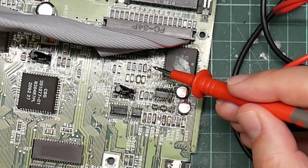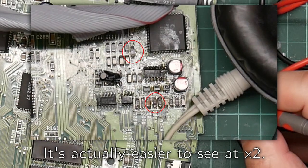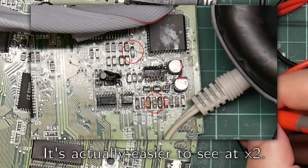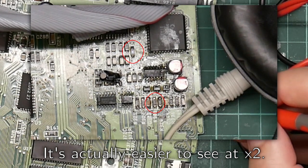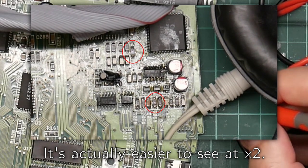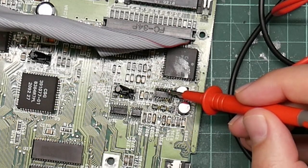These go through this defunct 10 ohm resistor and this 10 ohm resistor, which has survived. Now, if I look at the footage in slow motion, you can see this distortion around the two resistors. I originally thought that was evaporating IPA, which had been trapped under the component. That is not true. What you're seeing there are the power rails actually buckling from the heat. This is not good.